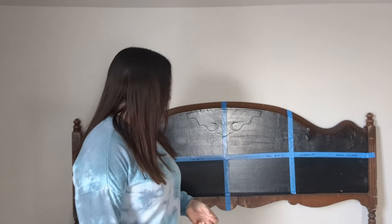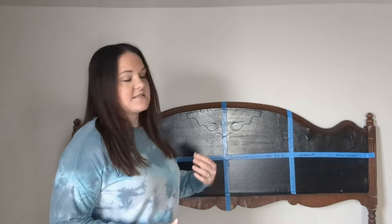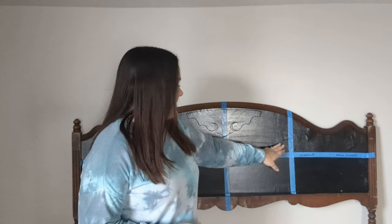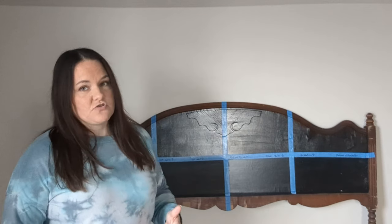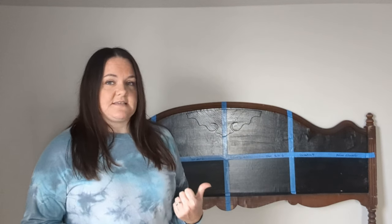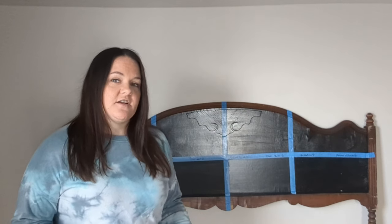Another problem child was the Beyond Paint multi-purpose sealer. It goes on very differently than other sealers — it's very watery and liquidy, and you need to use just the most minuscule amount when applying. It doesn't have the same grayish cast, but it still has stripes where the sealer overlapped slightly. You can do extra work to prevent that, and I've used it before with beautiful results, but you shouldn't have to work extra hard just to get a great finish the way you can with other sealers.